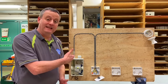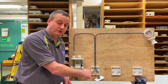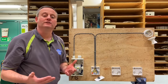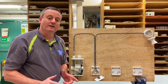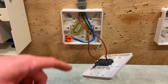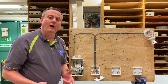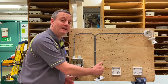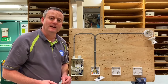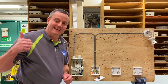The feed came from the consumer unit — though it could come from another room within the dwelling — and that supply went straight to the switch. From the switch we went up to one lighting point, though often it's to many down lighters. The advantage is we reduce the number of cables at the lighting point, making connections for neutrals, switching line, and CPCs all within the switch itself. This was a one-way method, which can be extended to two-way and two-way intermediate in future video presentations.